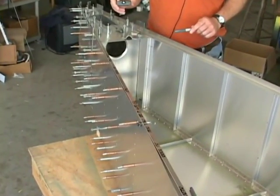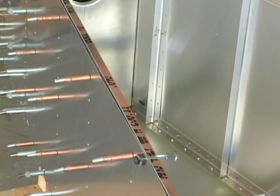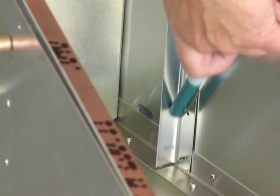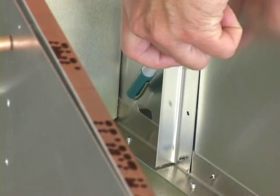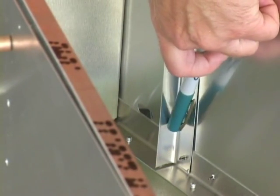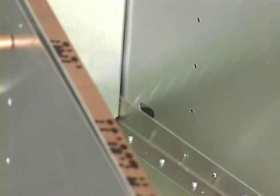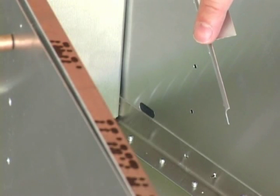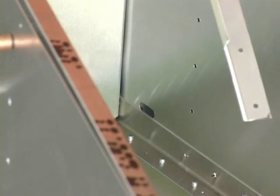One of the vertical L's that are just in front of the cable outlet opening needs to be removed and trimmed. Right in here, we're going to trim this flange off because the cable is going to come by here and go out the opening, and this flange is in the way. So we're going to mark 50mm up and remove just this flange on both sides. A hole was drilled to get a radius right at the corner, and then trimmed from both directions.